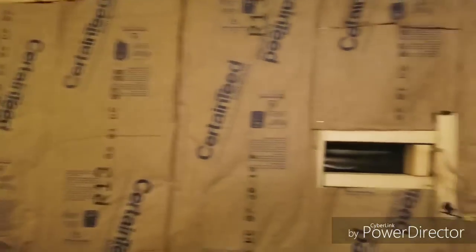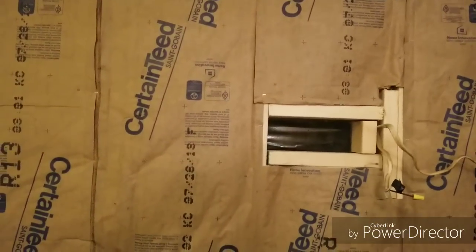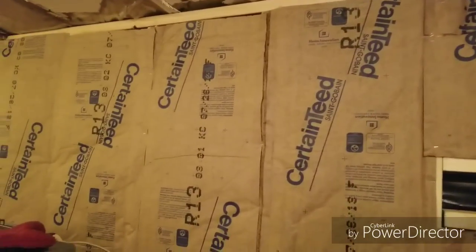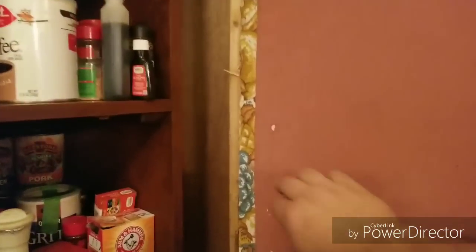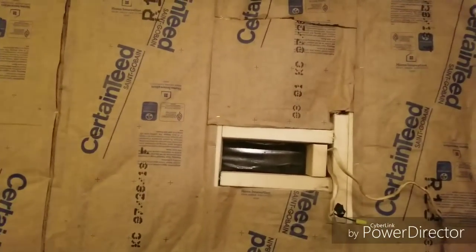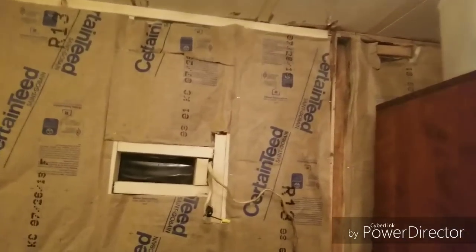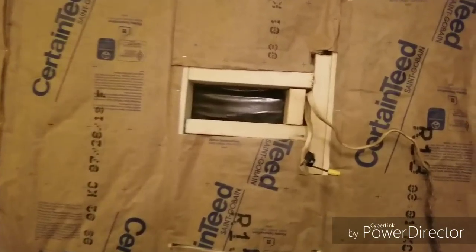Here's my wall in my kitchen — this is where the old oven hood went. I framed this up quickly just to have something there, but I'm taking it all out. When you redo a wall in a mobile home with water damage, you just take the paneling off. Get your pry bar and a hammer, take your trim section off, pull the paneling out and take your time, and you'll expose the insulation.